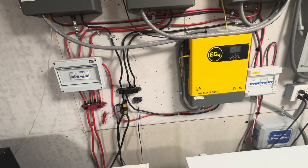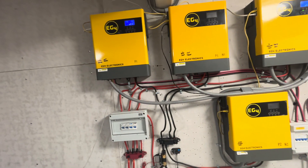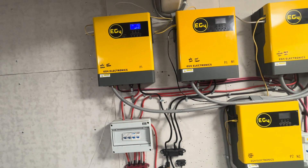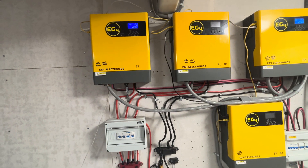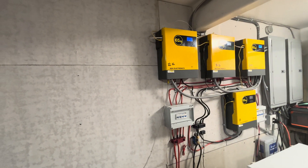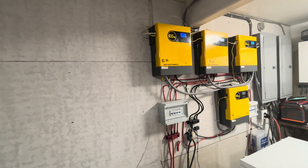We might put a separate unit up that's 120-volt for that seventh array — I think it's 20 or 22 panels at 250 watts, so that's over 4,000 watts. We could easily run a mini-split or two — actually two mini-splits — with it.